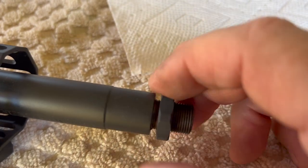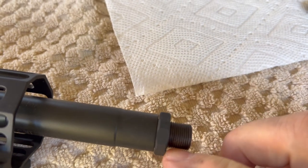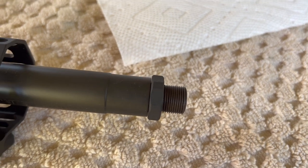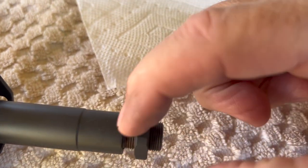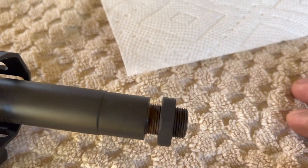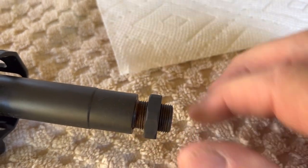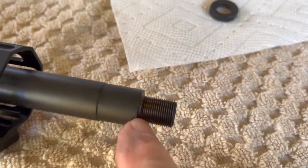Okay so this is JP Enterprises — the chamfer is only on one side of the jam nut. You can see that because of the more generous chamfer on their jam nut, it goes right up against this Criterion barrel that uses threads all the way to the face of the barrel. Now if you have one of these barrels that has a generous relief cut in there, this won't be an issue. But there are pros and cons to doing it each way depending on what type of muzzle device you're using, whether you're going to run a can, whether it's a direct-thread can, or a muzzle device you spin your can onto. In this case I'm going to be using the JP Enterprises just because I can start off closer to being flush.